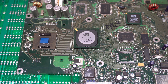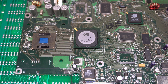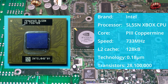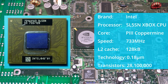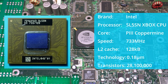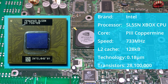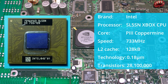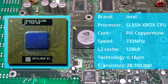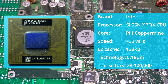I gave the chips a nice wash and now we can have a closer look. I placed them on the positions where they were soldered before. A custom Coppermine-based Pentium 3 was developed especially for Microsoft's Xbox game console. This Xbox CPU is a 32-bit, 733 MHz custom Intel Pentium 3. The only significant change from the PC CPU versions is that the chip has lost half of its second-level cache, dropping it down to 128 KB. The CPU was manufactured using the same Micro-PGA 2 packaging as notebook chips, but in a BGA format.